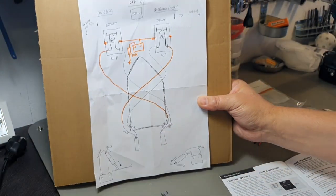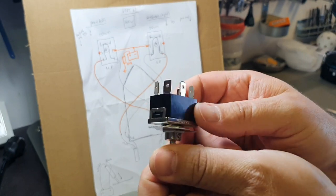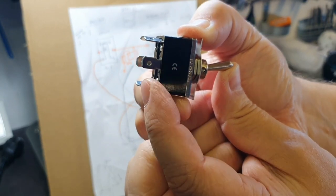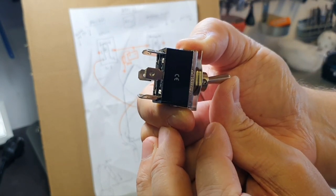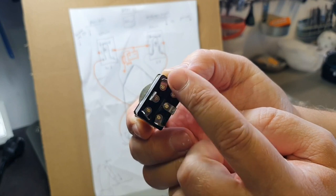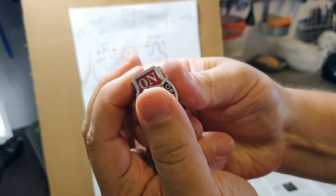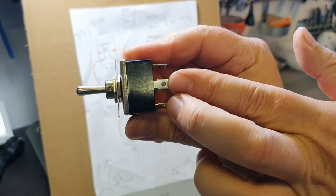Then about the switches themselves. I haven't seen any switches that work differently. When you press in one direction, it shorts these contacts. When you press in the other direction, it shorts those contacts. So opposite, let's say. Any switch I have seen works this way. And we decided that the switch we need is double pole, so they are independent pairs of contacts. When we push it up, it is a momentary switch because it returns to its central position. We need this. So when we push it up, it shorts these contacts.